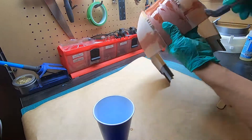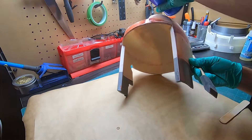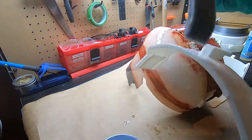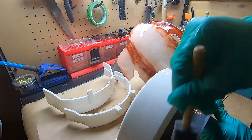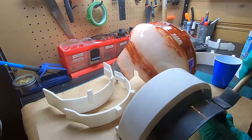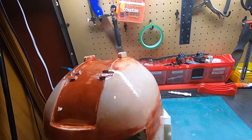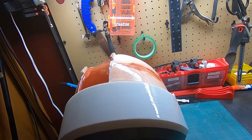I made sure to cover my work area and have good lighting, otherwise you might miss spots where the epoxy begins to pull. After I apply it to every part, I go back and spread the epoxy as needed. Overall the result was good, but there were some areas where I didn't apply it correctly, so I'll need to go back and sand down the drips and high spots.